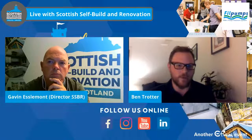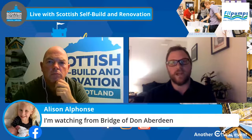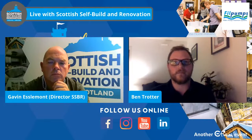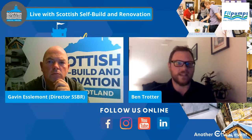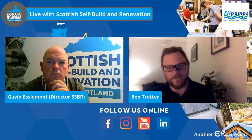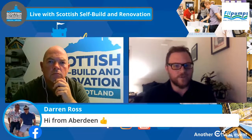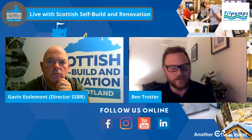The only permission that you might possibly need, which is highly unlikely to ever be relevant to anyone building just their own home, depends on how much water you would be wanting to take out of the ground. You might have to notify SEPA, but that's purely from levels of 10,000 litres a day upwards. Even huge properties, 5-6 bedroom, might only be using 1,800 to 2,000 litres a day at a push. To be using 10,000 litres or more, you are talking about larger scale farms, veering towards commercial or industrial level. So as long as you've got permission to drill on your land, you don't need planning permission, to my knowledge.